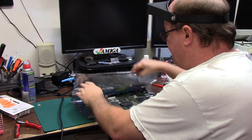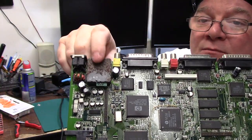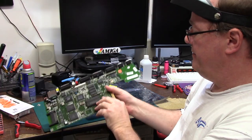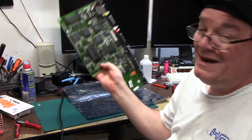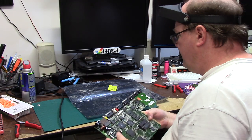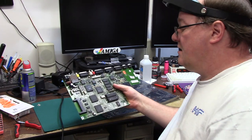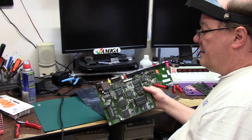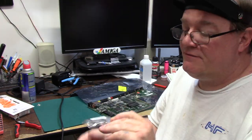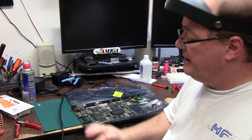Also along for the ride is another Amiga 1200 in for a recap and removal of this rusty RF modulator. It's very clean on the bottom. This is a 1b — an earlier model, not your 1d. It works very well, has the normal Commodore fixes, everything looks well, caps are a little crusty. We have a new self-supplied kit from amigastore.eu that the owner provided.